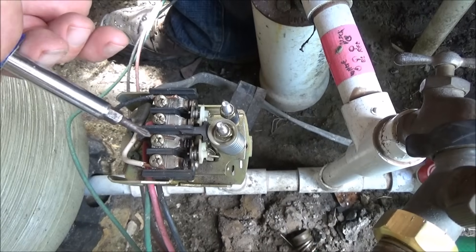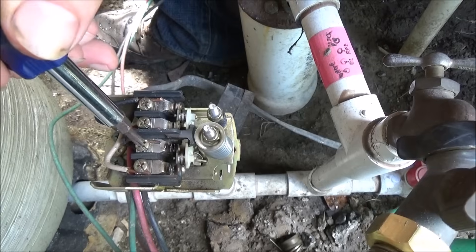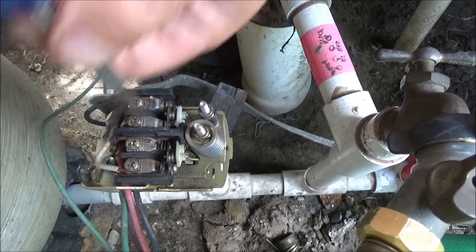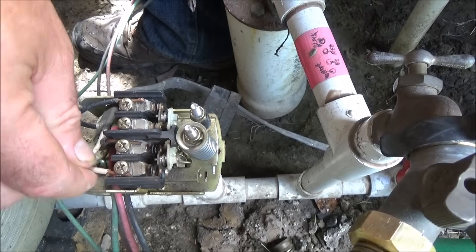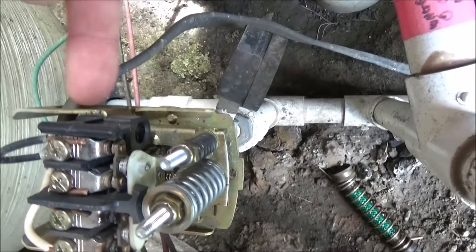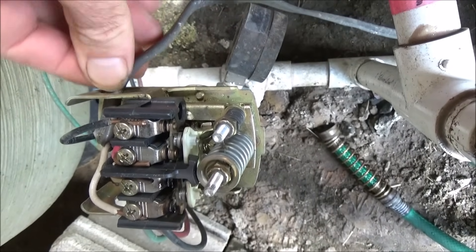Number one, each of these wires should be on the left side. That's because as you tighten the screw clockwise, it's going to pull the wire in tighter. If you tighten it and the wire is on the right side, it could actually work its way out. That's fairly minor, but right here you should have some type of protective guard so that the sharp edge can't abrade the wire and also to keep out a little bit of moisture.